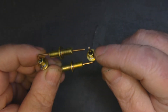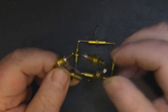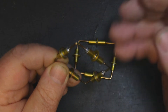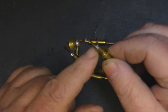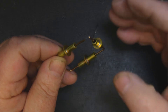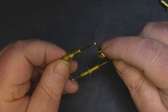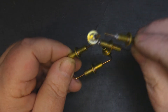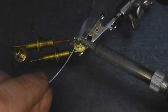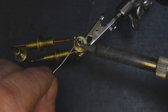Now we're going to flood some solder down into the tube to create an electrical connection between the tube and the brass brazing rod. When prototyping I used aluminium foil inside for the connection, but it was more fiddly than masking tape and there's no need since we're creating the electrical connection with solder. I hook this up to the helping hands and flood each one individually — heat up the wire first, flood some solder in, then get the soldering iron around the top of the tube and it kind of just snaps together using surface tension.